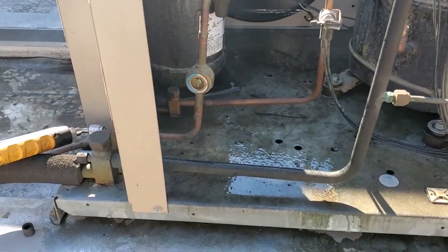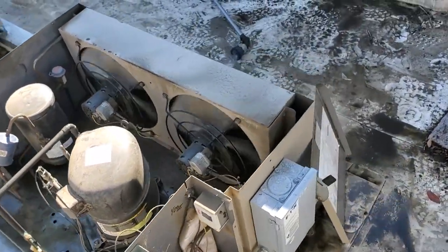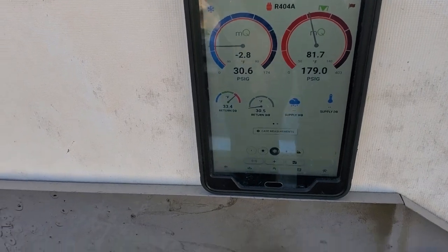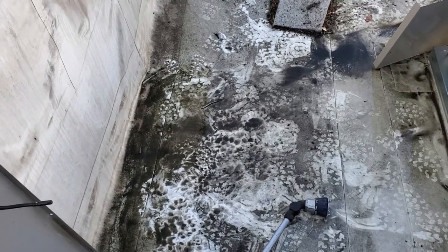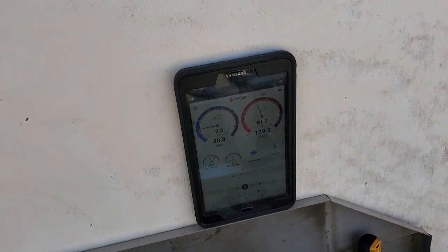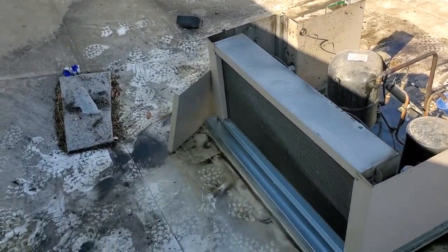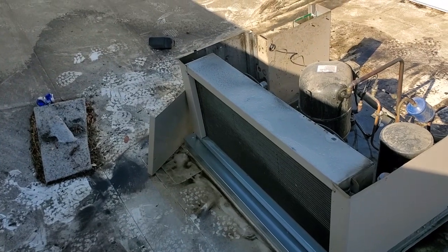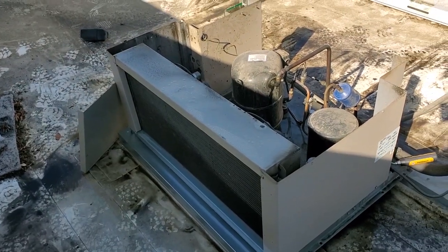We are still running with a flashing sight glass. What I did is use a mister to keep my head pressure just below the bypass pressure of the head pressure control valve. This isn't really a good method unless you're very careful, because the fear is that you can overcharge a system. You don't want to saturate the condenser to the point that it brings the condensing temp down way too low — lower than it'll ever be — because then you could potentially overcharge the system. I'm just using the mister to verify whether it really was low on gas.